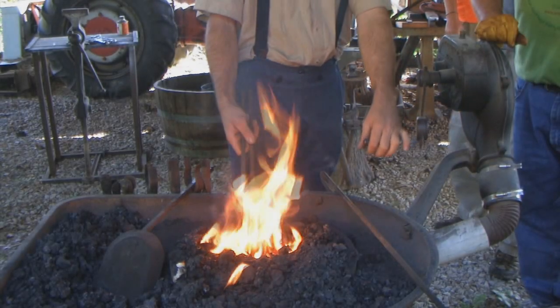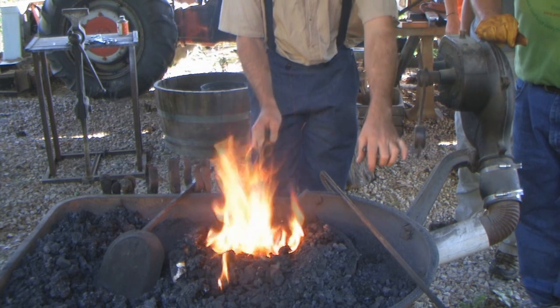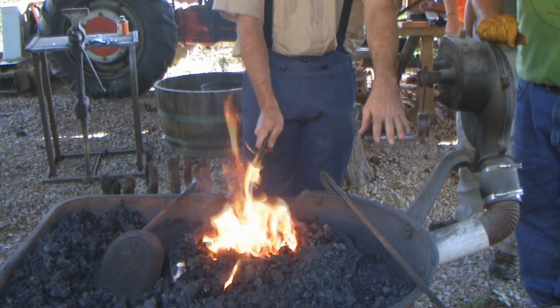Good enough to temper — that's about the color you want when you temper your steel. For sure, with hard steel you don't want it really bright. If you get it really bright, it'll get extremely brittle.